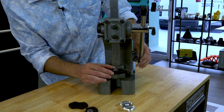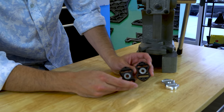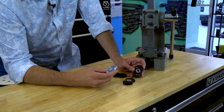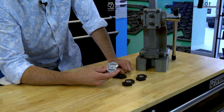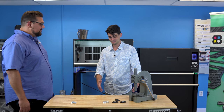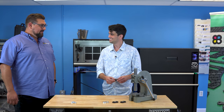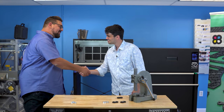And we haven't even talked about the machined part yet — I still need to go home, use the soft jaws, probe the part into place, switch to a cutter that can take out the pocket for the bearing, and then chamfer that. These SLS parts are done. Just to summarize, we went from a part that we didn't know anything about to a 3D model that we knew a lot about, to a functional design that meets our criteria to fit that nice 8mm bearing. All in a day's work around here. Thank you so much. It's really fun working on this project with you.